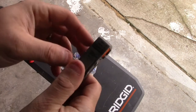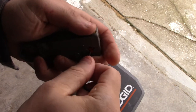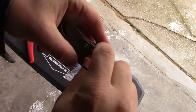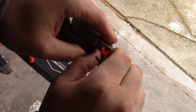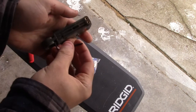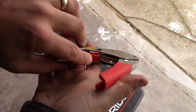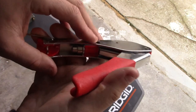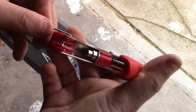So as far as everything that comes in this box — I'm going to be honest with you, this is pretty easy to use. I was a little intimidated at first. It does come with the wrench, and you can push this out for different gauges. Once again we're using the RG6 and RG59 — you just put it on 6 and you're good to go. For different gauges, just turn it around and push it in. The hardest part is actually adjusting your blades to make sure it makes two cuts, because there are two blades in there. But it's pretty simple — you can just store the wrench right back in there. As for the crimping tool itself, this thing is actually pretty heavy-duty. I wish there was an adjustment on here. I've used different types of compression connections and didn't have any problems, but the more expensive ones can adjust a little so you don't have any wiggle room with the connectors. No problem at all — it's pretty sturdy and pretty easy to do, and you don't feel any resistance when compressing those fittings.